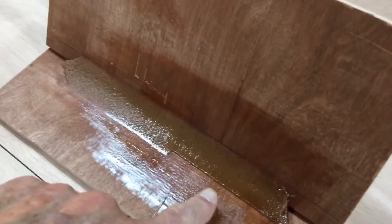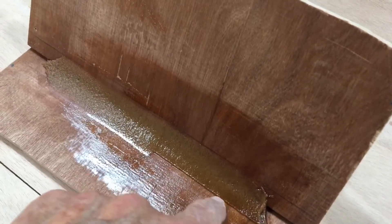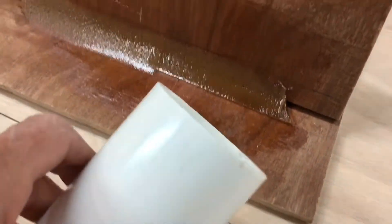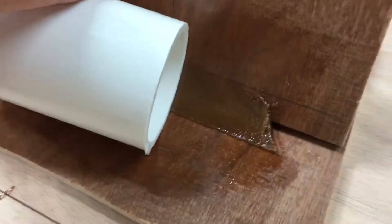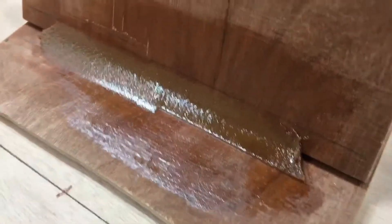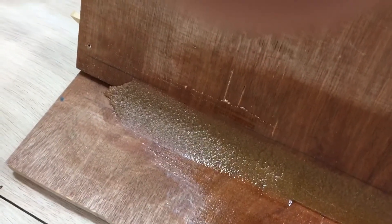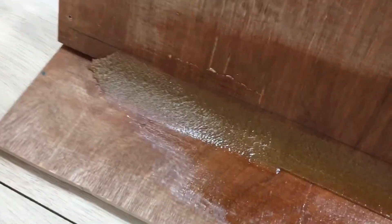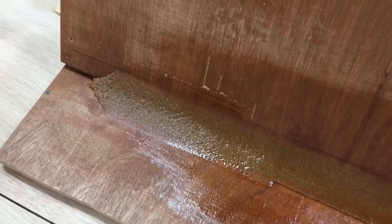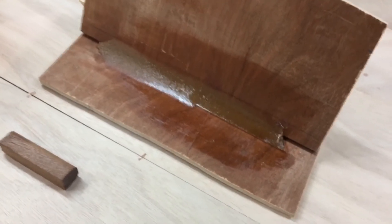On the right, this process was done using tape — I had nice clean tape lines. I was using this PVC pipe which is two and three-eighths inch diameter, and you can see how the pipe forms a nice smooth curve in the fillet at this approximate angle. This one was done with the pipe but with no tape, so the edge is not quite so well defined. It just depends on how particular you want to be — are you building a boat or are you building furniture?